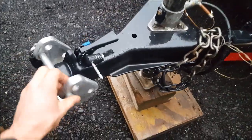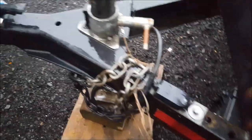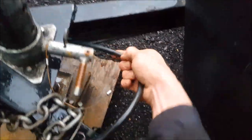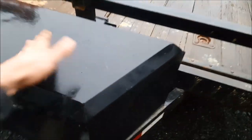When you're all done with the trailer, make sure you've got both coupler locks on. This is locked in a down position — not that that's really going to stop anybody who really wants the trailer. You've got all the trailer connections and chains up off the ground, not sitting in the dirt, and the wire. Keep this all tucked under here, out of the rain and the sunlight. And you've got this front box locked, taking the key with you.